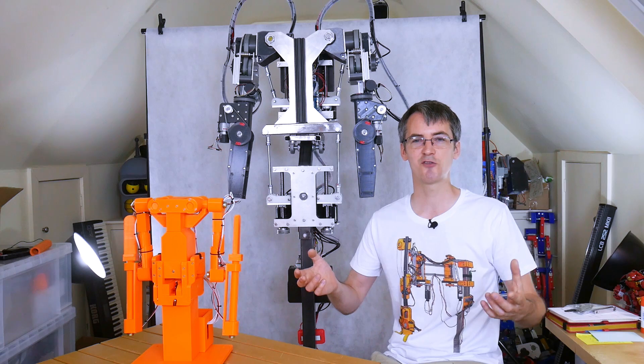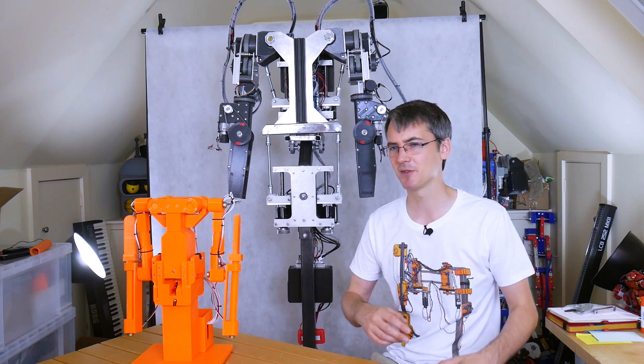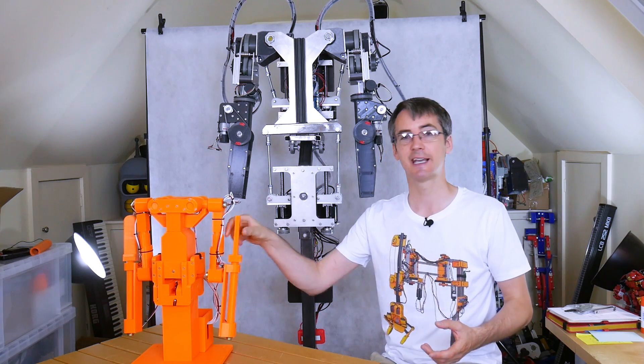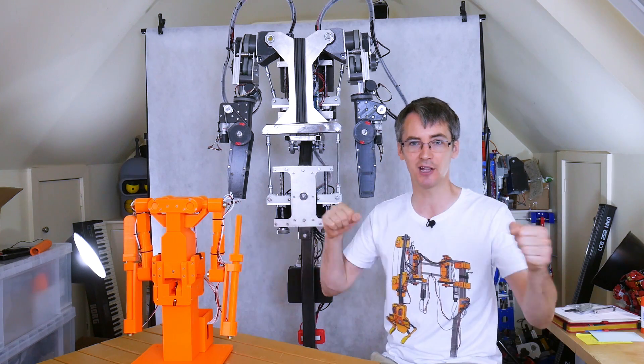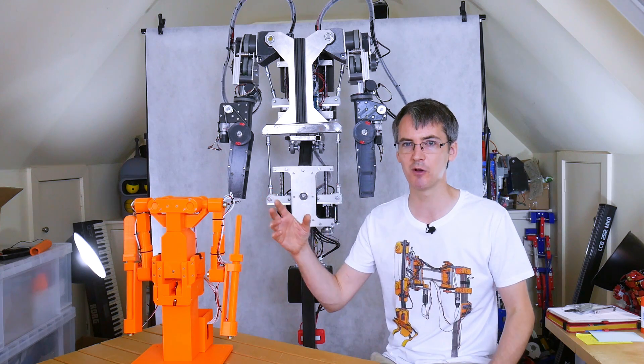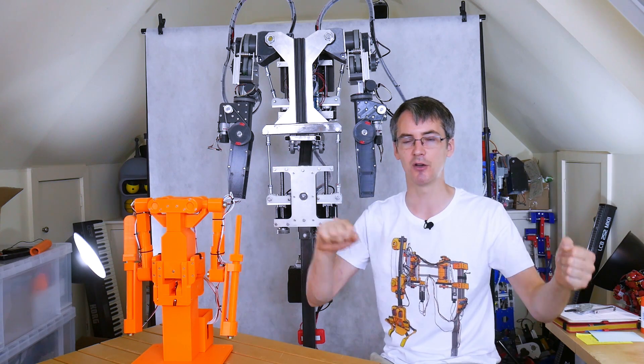I think that was a pretty successful puppeteering test. You'll notice sometimes the robot seems a bit laggy - it doesn't go as fast as I can move these joints quickly. It could actually go faster and be more agile, but we've got quite a big motion filter on there. We've got a first order filter taking all the sharp edges off so we get a nice smooth motion.